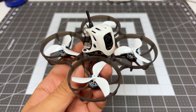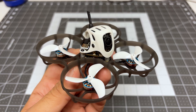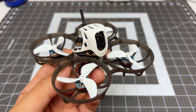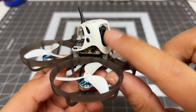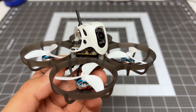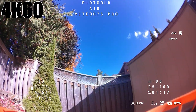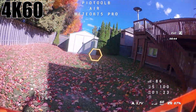In the last eight or nine months, we've learned quite a bit about the DJI O4 Lite system, and we've also learned a lot about the nuances and sensitivities of this camera. One of those unfortunate nuances is just how susceptible this camera is to any kind of vibration. Now this is not BetaFPV's fault — you can see BetaFPV has done whatever they can to isolate this camera — but it's just the realities of what we have here from DJI. If you fly this quad in really bright weather, you will see jello — not shakes, but jello is where you see wiggling of the image.